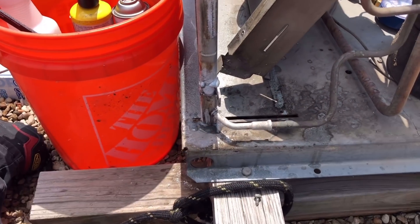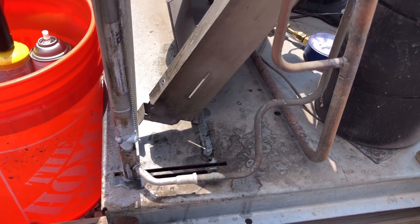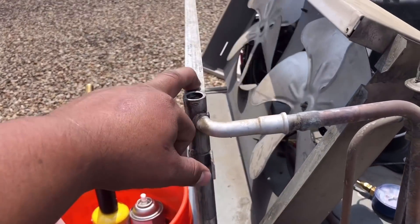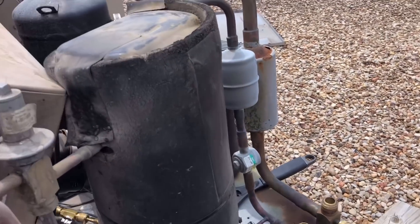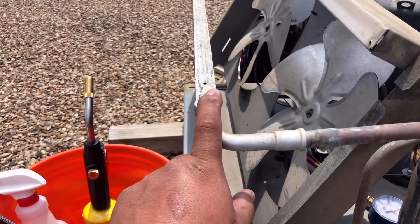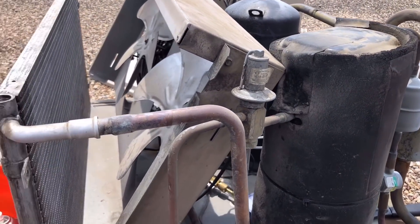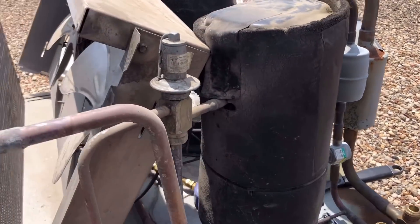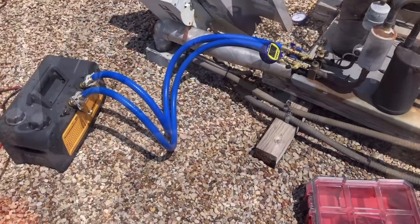I don't want to cost the customer any more money in labor and material. I'm going to call it quits — we'll pull a vacuum on the condensing unit as best we can. Since we know we have a leak, if we get it down to around 5,000 microns I'll let it go and submit a quote to repair this. The two dryers I was going to change today — no point if we're opening the system up in a week. The coil is about four days out, so we'll bid them a new coil, two new dryers, and virgin refrigerant.